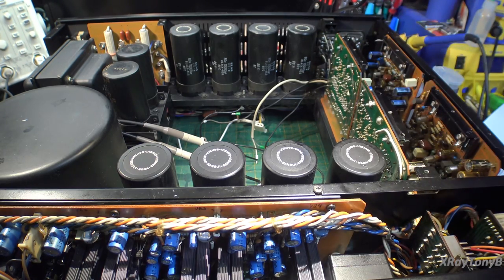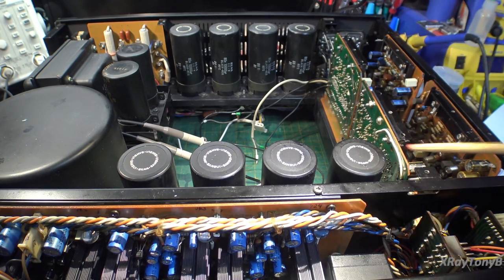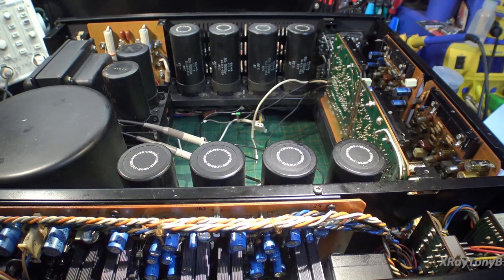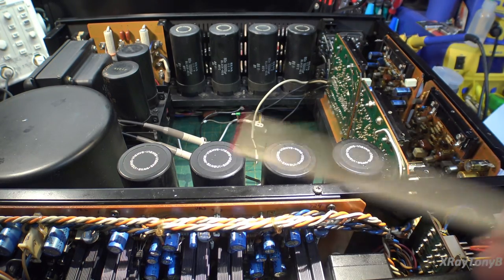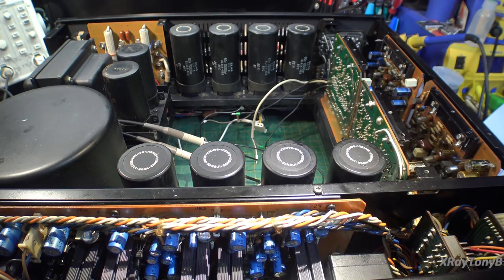Turn moving coil on and off — you can hear the relays kicking in and out. When the relay pulls in I can actually see the bounce on the contacts. It does put a high frequency pulse on there but it's very short, very low amplitude, and it goes away instantaneously — it doesn't carry on any kind of oscillation. So I think we've solved all our problems with that. Let me hook this up, put a scope on there. I'm not going to use my little phono box yet, but I'll just feed a basic signal in — the impedance is going to be all wrong, but at least it'll be the correct voltage level and we can see how the preamp works.